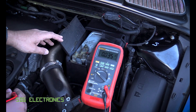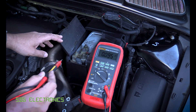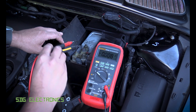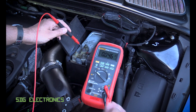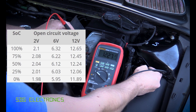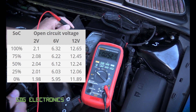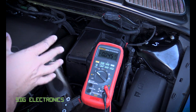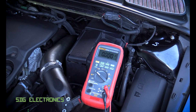Similarly, we can check that the system is able to charge the battery because the alternator voltage will be quite a lot higher than the basic battery voltage, but again it doesn't tell us much about the details of the system. What I'm noticing is the battery voltage remains quite low even after a long drive — it's reading about 12.27 volts after a 60 mile drive, and when charging it was at about 14.4 volts, which is quite standard for one of these smart charging systems.